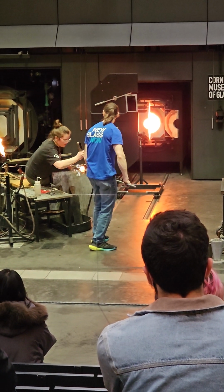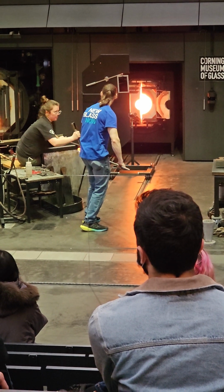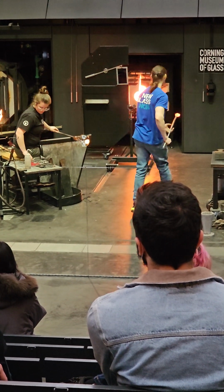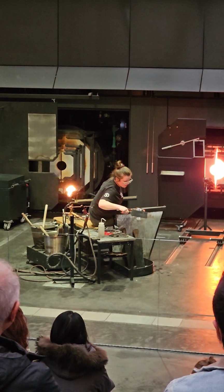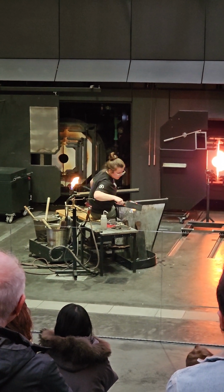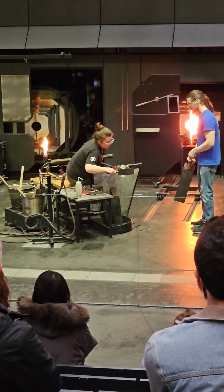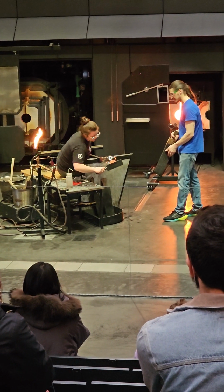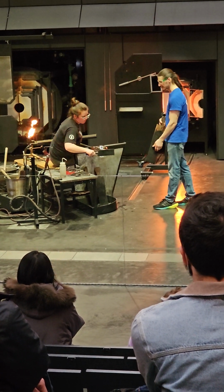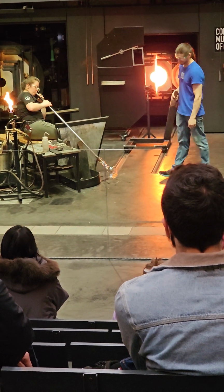She stops it, flips it back on center, and she winds it right on there. Hot glass will stick to hot glass. We call this process casting off because she didn't have to cut it with shears or anything. She literally used the hot material. If it gets thin enough, it'll burn itself right off. So she wound it around, and as soon as that little string got thin enough, she throws it towards the ground. That string gets so thin that it winds around that hot glass, and the hot glass melts it right off.